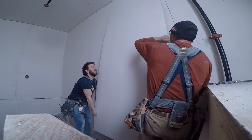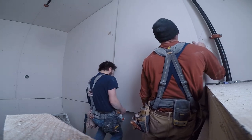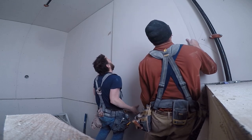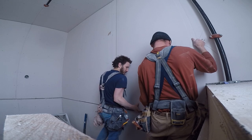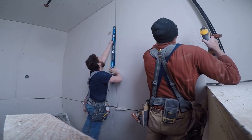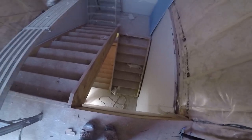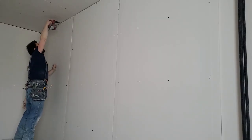Now we have the plank in a different area, a lower area, so we can lift the sheets up again onto our spacers. One of the key things to remember is to always have what you need close by. Before you start lifting sheets, make sure you have all the tools and fasteners that you need before you lift the sheet — especially when you're doing the lids, because you need to get those screws in really, really quick. It could be quite a drop, so you need to be very, very careful.